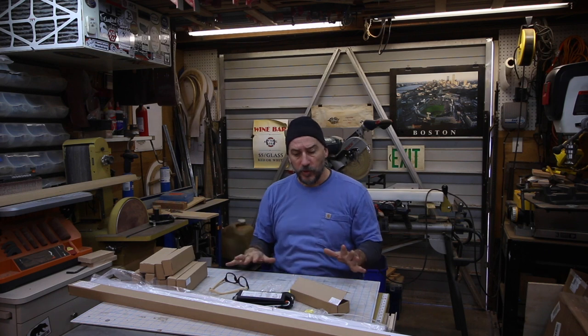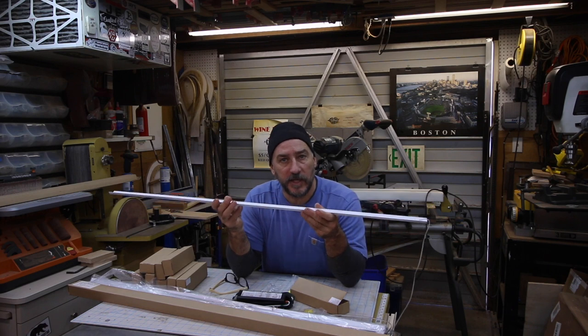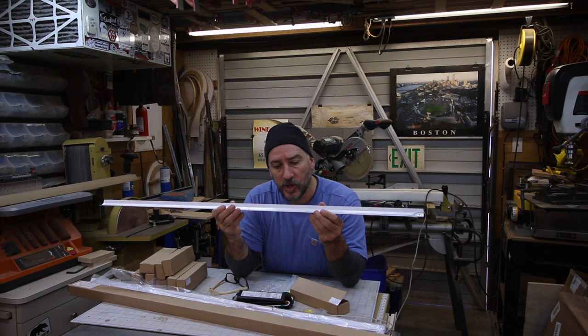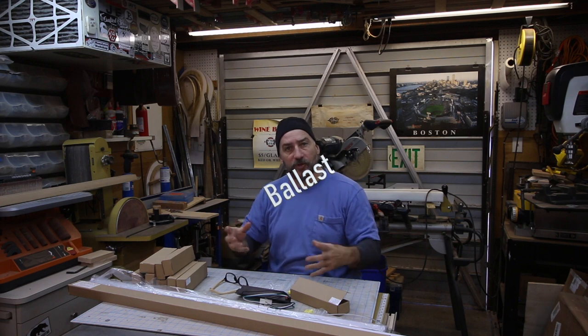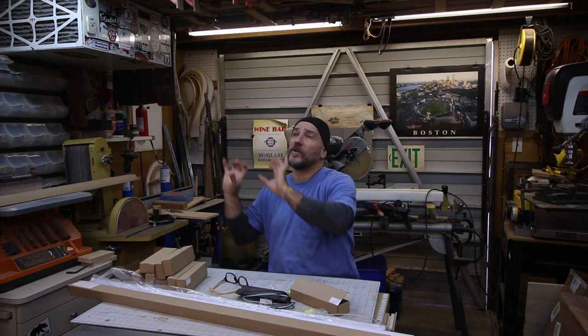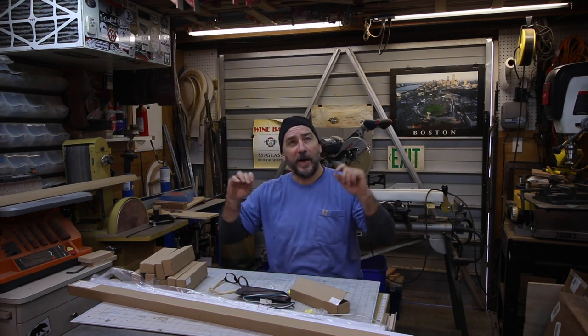So what I'm going to do is change it out with these American Green Light strips that I purchased. It's a retrofit kit which comes with the LED strip, and it comes with an LED driver. What you're able to do is take the old fixtures, take out the bulbs, take out the ballast, rewire it, put these LED strips in there, and then use the same fixtures and shove them back up into the ceiling. So I'm excited about having all the same lighting throughout the shop.